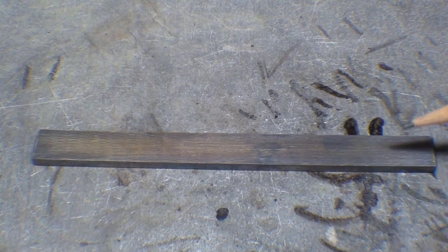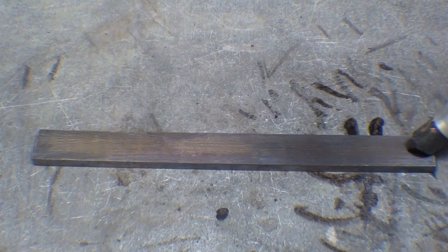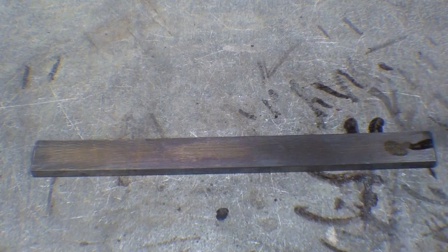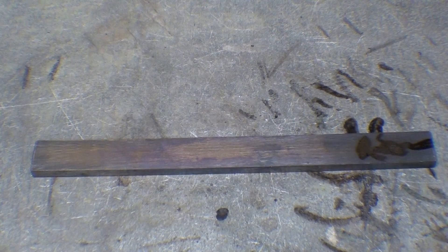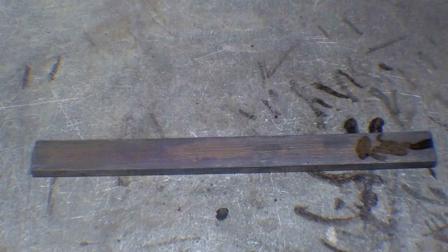Can you see the straw color? And now a little bit of bluish or purple coloring starting to appear. This can be done with your torch. Here's the 450 — we know it's at 450. Here's the 500, that feels like it's melting. And here's the 550 — so it's at least at 550. And the blue color is coming out. That's approximately where I want to stop it, take it off, and quench it. Then that color will remain on there, but if you get it too hot the color again is going to go away.